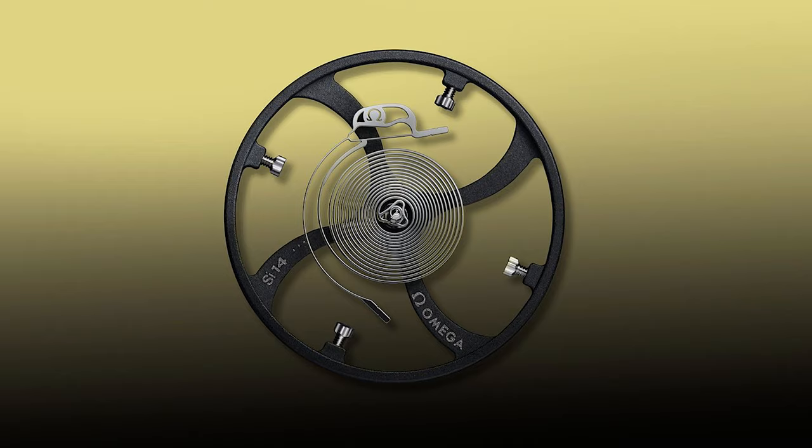It's got a flexible blade attached to the hairspring that can be easily adjusted to affect the stiffness of the hairspring. So it's not about adjusting the length or about adjusting the weight going inwards or outwards, although it has that system as well. So it's double dipping on accuracy. It's free sprung with a SPIRATE, which adjusts the stiffness of the hairspring.